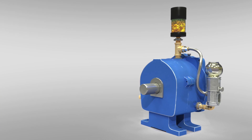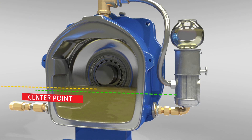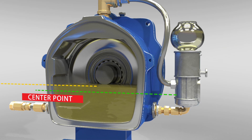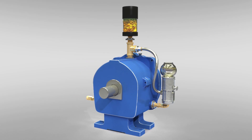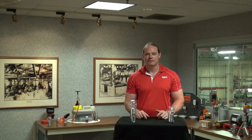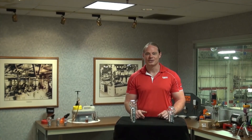Note: there is one thing to keep in mind. When you fill the equipment often, it's possible to overfill the equipment because upon removal of the bulb, a small amount of lubricant does expel into the equipment. If done frequently, this can cause the level to rise. If you have more questions about lubrication, re-lubrication, or Trico's standard vented or Optomatic Oiler, please give us a call.